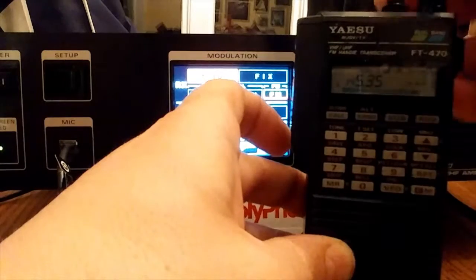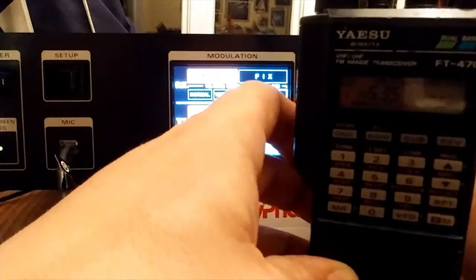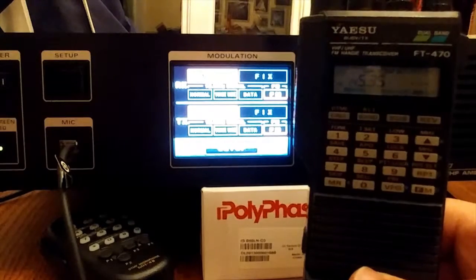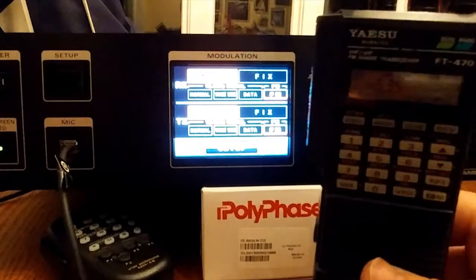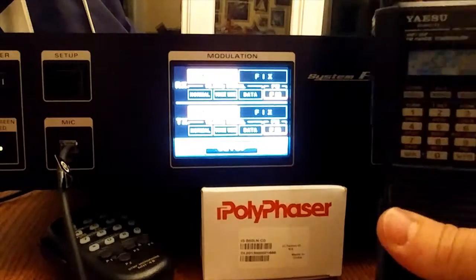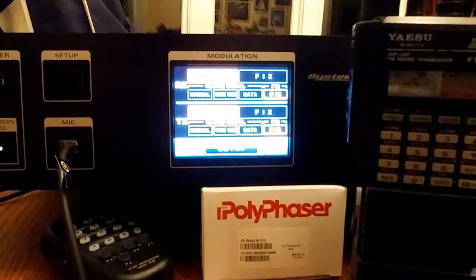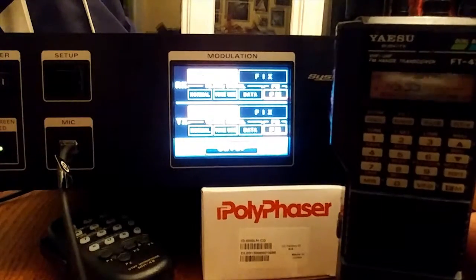Nope, it's not there. That means my firmware update feature is actually working, and it's not transmitting a CTCSS tone while it's IDing. So if this was a link receiver, it would not trigger its signal detect to my controller and repeat that signal if I was using a PL tap for it. So I like to use a combination of COR, COS, and PL when I'm doing links, and then do an OR, or an AND logic.